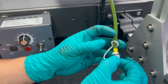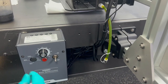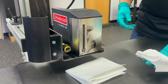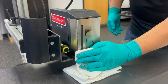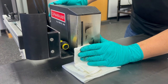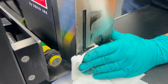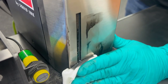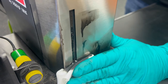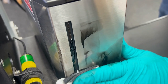Go ahead and cap the drain tube and make sure that's snug. Now we're going to go ahead and purge all the solvent and cleaner out of the print engine itself. We're going to take our lint-free wipe, fold it in our hands, start at the bottom of the print engine at the opening, go to the back of the print head and press and hold. We're looking to drain all that fluid from the print engine itself. At this stage it shouldn't be much fluid — you should see mostly air. I'm looking to see those bubbles almost all the way alongside the print engine itself.